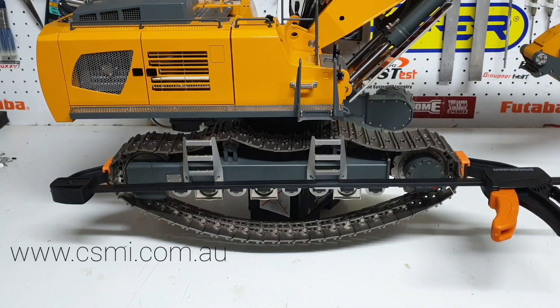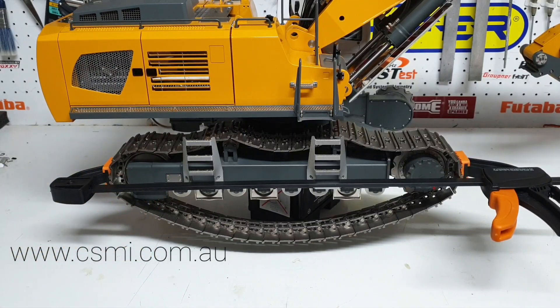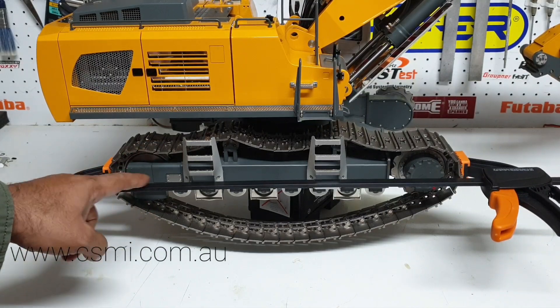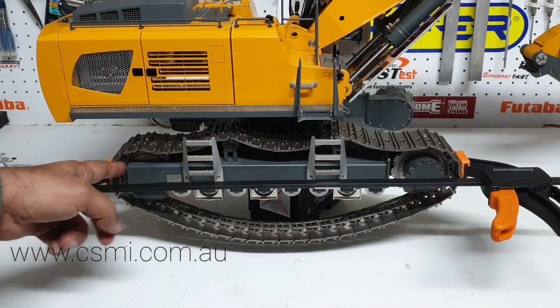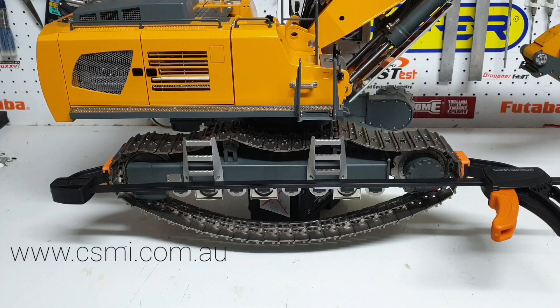Once the wheel is retracted, I'll take the F-clamp out and then I can take the track out. The wheel stays in that position because of the pin, not letting it release out. Once you actually take the track out, it's a good idea to put the F-clamp back again, take the pin out, and slowly release the F-clamp so you don't have the wheel under tension for no reason. Then you can remount it once you're ready to put everything back together.